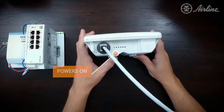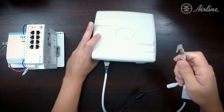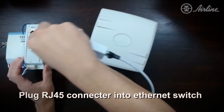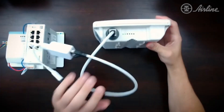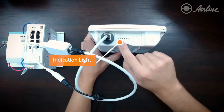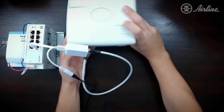After a few seconds, you can see the power is on in the radio. Then I'll use the other RJ45 connection on the PoE injector to plug into my Ethernet switch. After I plug that in, you'll see a link indication LED on the radio itself, which means it is connected to that switch.